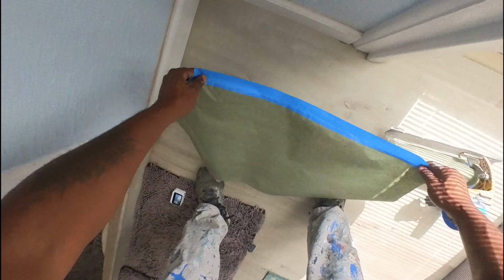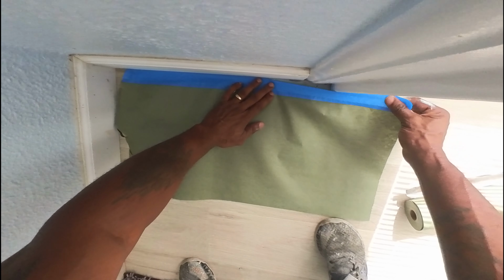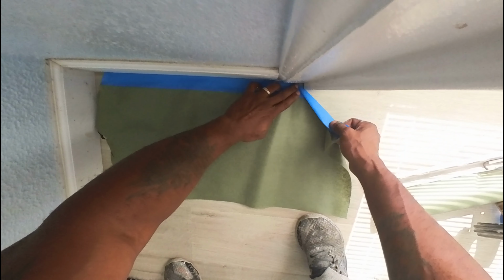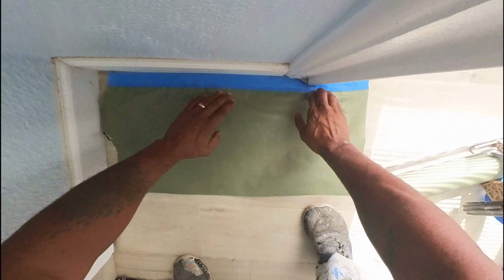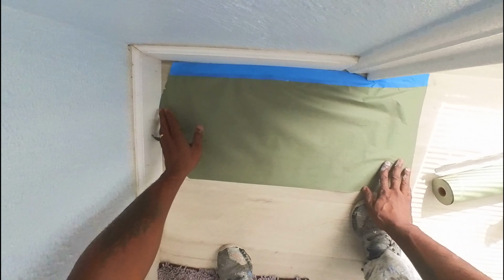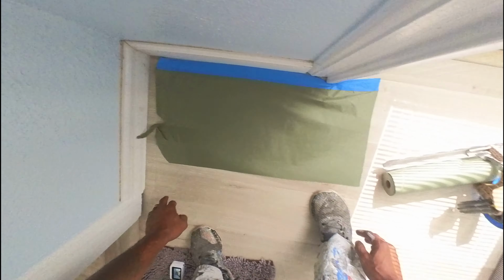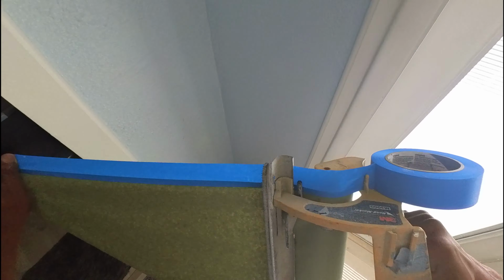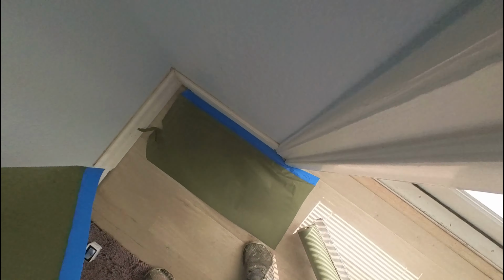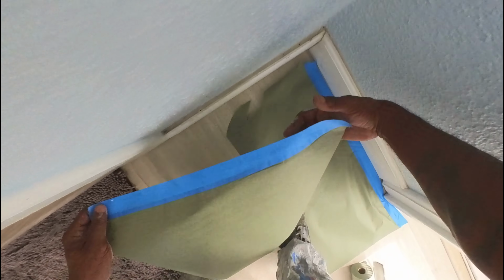Once you're done cleaning the floors, then you're going to want to prep them. This will help your paint job move a lot smoother and with less cleanup in the end. When we're looking to prep with paper, then the 3M masking machine is definitely the way to go. It gives you a good foot of area away from the baseboards for accidents and spills. The last thing we want to do is get paint on a client's carpet, tile, or hardwood floors. If you want a quick, clean, and efficient paint job, then prepping the right way is key.